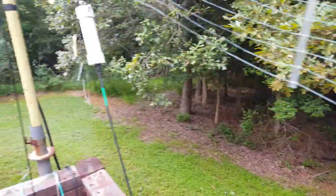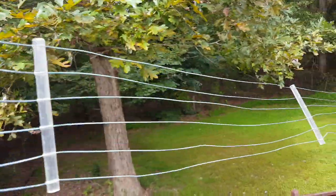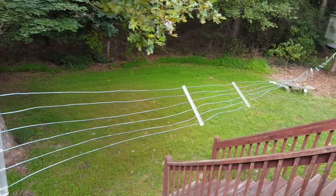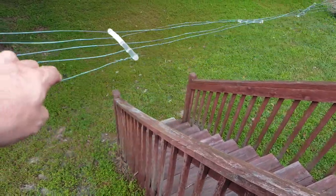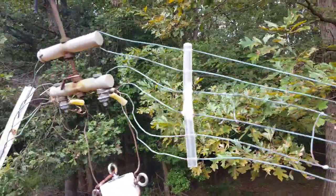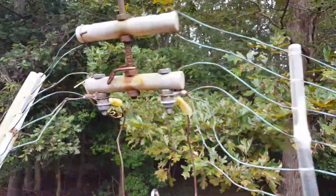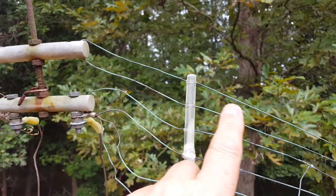These things broke — you could just use glue sticks as your separators, kind of like the waves on a flag. It's a bit green from oxidation. On 80 meters it's a folded dipole, so it'll go out and then to the end and all the way back. They're all at the central point — just folded back.